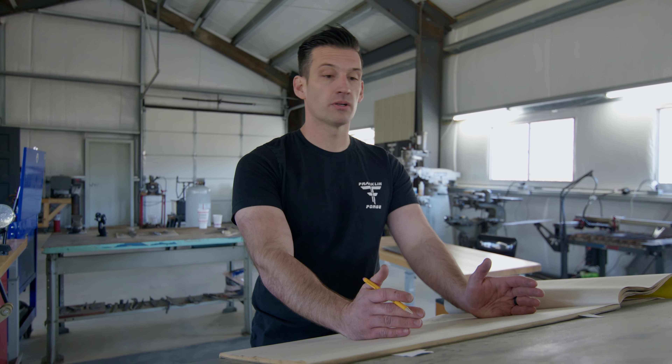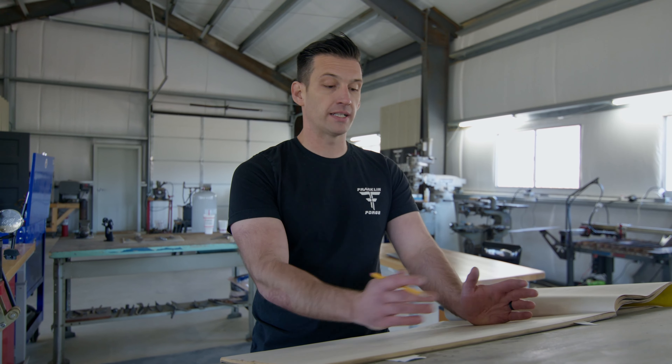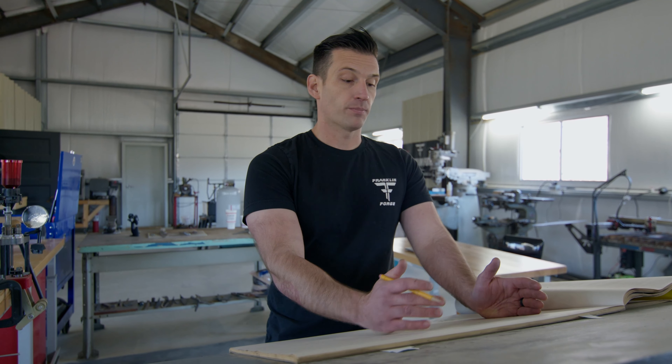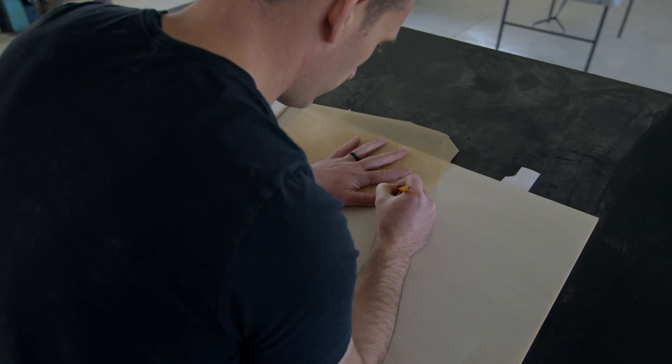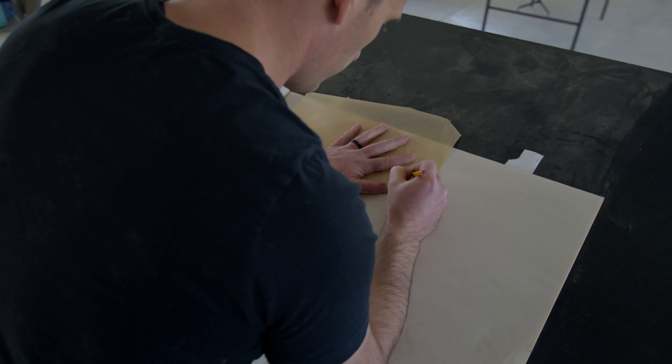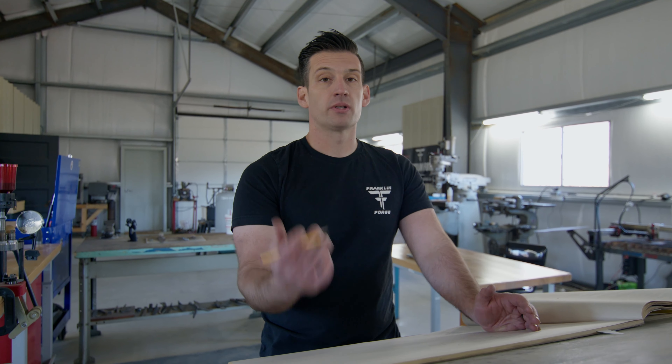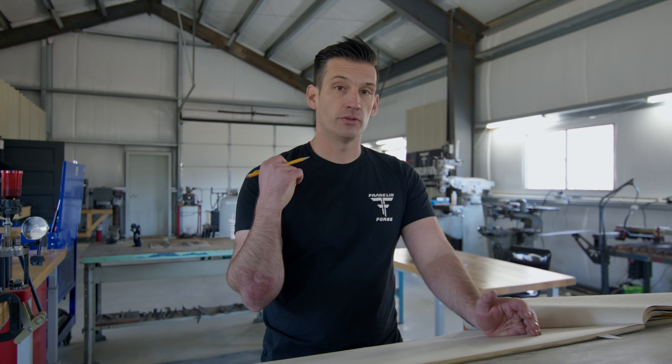I've got it on paper and I can always refer back to that. That's my master. I can change it if I want to, but that's the whole point of drawing it out — I make all my changes, come to my final product, and then I put tracing paper over it, trace that out, cut it out, and put it over onto a piece of wood. You can do it in metal if you wanted to. Now you have a more robust template that you can take with you to the forge. So tip number two is design — it goes hand in hand with slowing down. Design your knife first on paper before you put your steel in the forge.